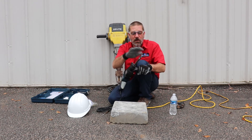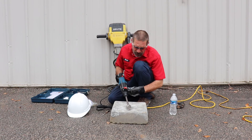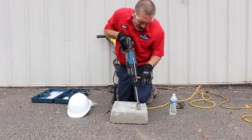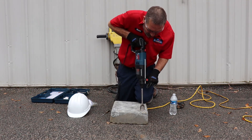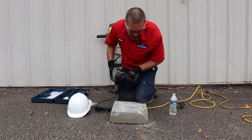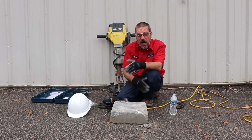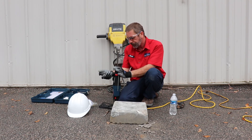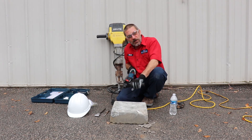Now let's do some chipping. Sometimes the chisel tip isn't positioned where you want it — I want it kind of flat so I'm just going to bump it into place. I'll put it on the straight hammer function and knock off the edge of this block. There you go — pretty much how it works. You're not going to use this little guy on your big jobs; that's what you've got the big jackhammer for. But that's the basic of how to use your chipping hammer slash hammer drill. Put that handle back, put it back in the box.